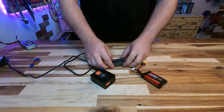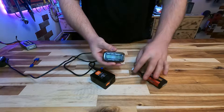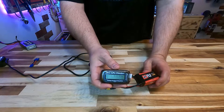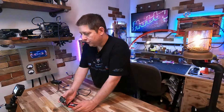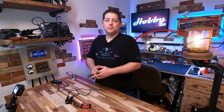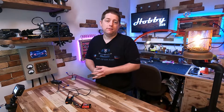You can use this LiPo checker to check your LiPo batteries for these low voltage errors. In the example of this battery pack here, this battery pack is showing error on all three cells. If you have a LiPo battery pack where only one cell is showing error, that's something that may be covered under warranty, so you'll want to get in touch with the manufacturer.